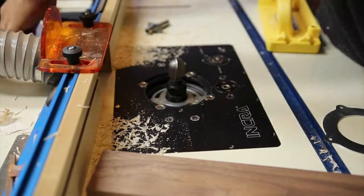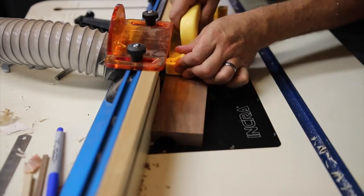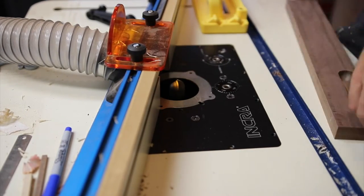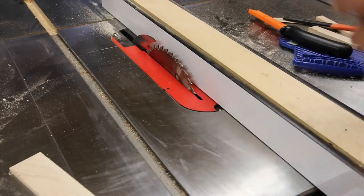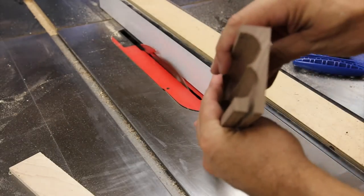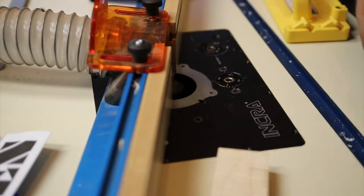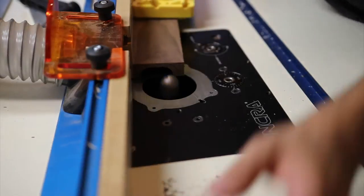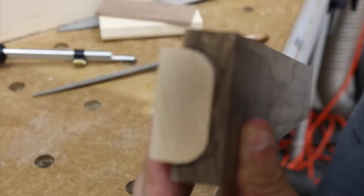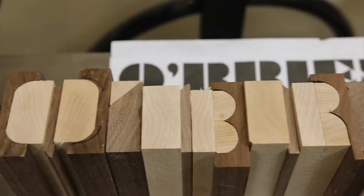So now we've got the B, the R, the N, and the E. The I is relatively simple. For the next piece, we're taking the walnut to create the actual negative side of the B. While you saw the positive side of the B with the maple, we have to create a recess carefully spaced so that when you put the two inserts in, you create that silhouette impression between the walnut and the maple. The R is not too much more difficult — just cut it down at the table saw, chop it out, and carefully fit it one piece at a time. For the O, it's pretty simple: just one block, round it on two sides, and cut down carefully. We create the positive side using walnut with the same half inch round over bit, then grind it out using some rasps to make sure it fits nice and smooth. Once you work on it, it comes together pretty well.